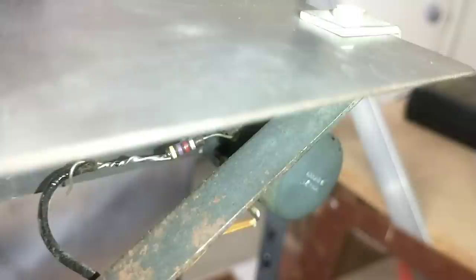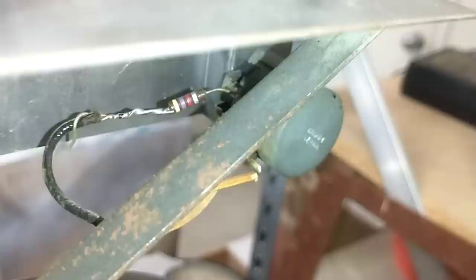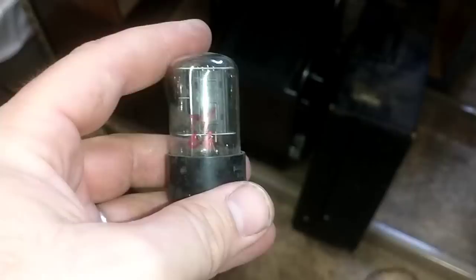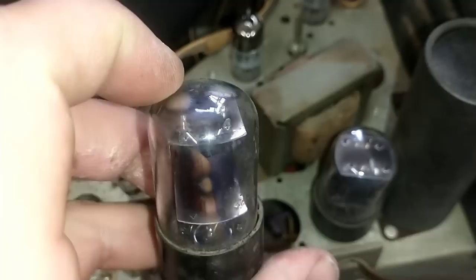I also have to think that maybe the CRT is the reason why the voltages are wrong — it could be bad. We don't really know. The tester says it's good, at least the Beltron does. I kind of want to stick the old tube back in there and see what it looks like. This is the 6SN7, which that brightness control is tied to. Let's see if this is okay. Somebody's marked it with transconductance values, but that didn't mean it didn't fail. So let's test it real quick.